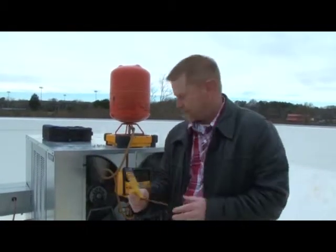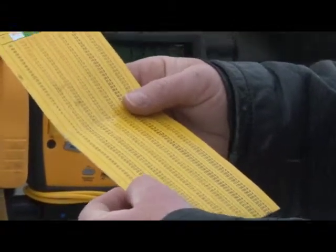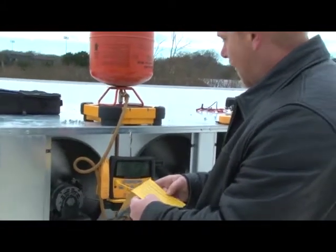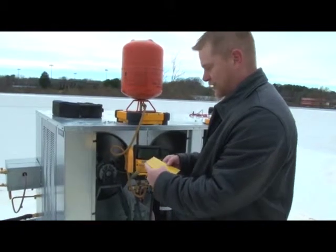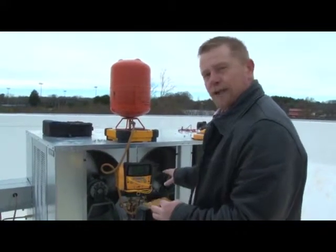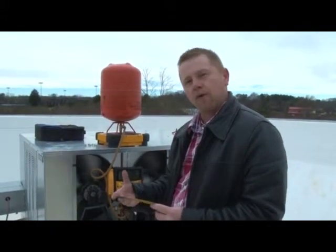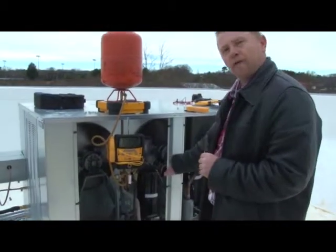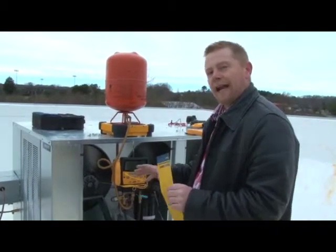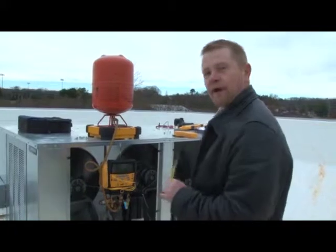Right now it's about 50 degrees outside. When I look at the PT chart, find 50 degrees — I'm adding about 10 degrees right now, that puts me at 60 degrees — gives me 124.2 PSI. I'm running 127.4 on my head pressure right now, which is about 61 and a half degrees, so I've got about 11 and a half degree differential right now. The compressor at this point is probably pulling half the amps of a normal system, which is considerably saving on the electrical bill. We have about five pounds of refrigerant in the freezer and three pounds in the cooler. The cooler should run fine with only three pounds of 404A refrigerant utilizing the floating head pressure.